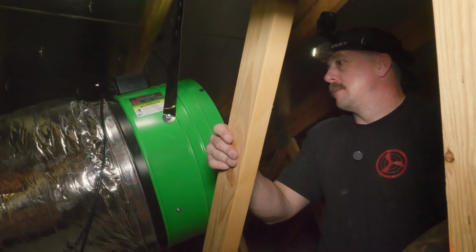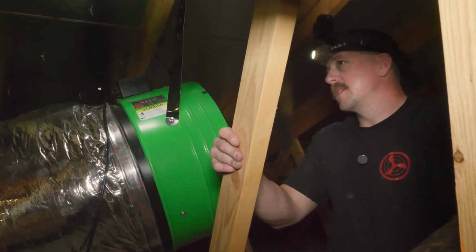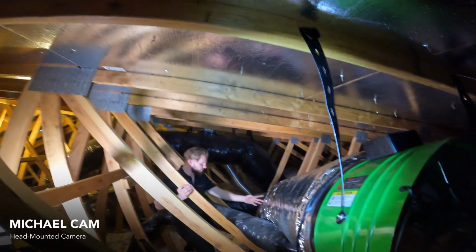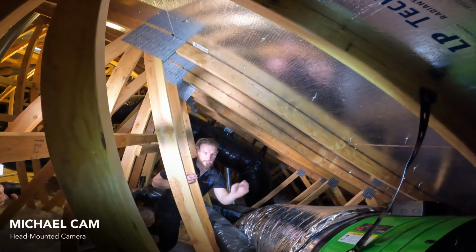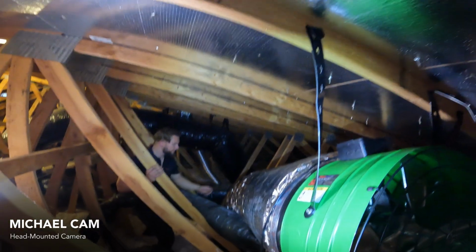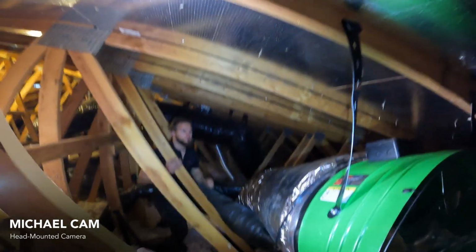So this is a 9-foot duct, you said? 9-foot ducts on all of our fans, 4,700 and above. So 1,400. So you're thinking maybe at least probably 3 feet away, maybe 6 feet away to hang this fan from the damper box is a good rule of thumb. As far as you can get it and still keeping a nice radius in it. Okay.